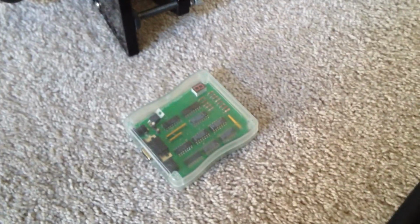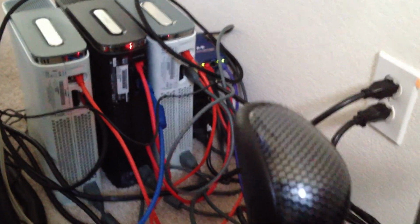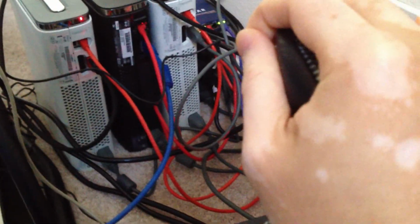But the nice thing I did was I took it a little bit further, and I decided that it would be cleaner if I didn't have to modify this joystick at all, and I could just take the USB output of this shifter and translate the actual USB control messages coming out of the shifter, and put them directly into the wheel. So how do I do that?